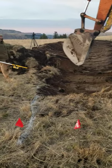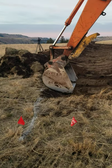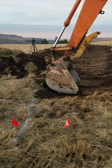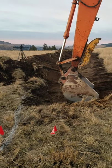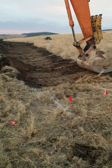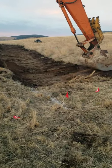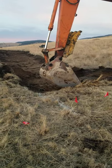We're going to dig along that white line, which is on contour 12 inches higher than the bottom of the swale. That means when the swale is full, it will have 12 inches of water allowed to infiltrate. If we do our job right, the water coming over that white line will be perfect sheet flow, which will have no erosive force. Stay tuned for more updates.